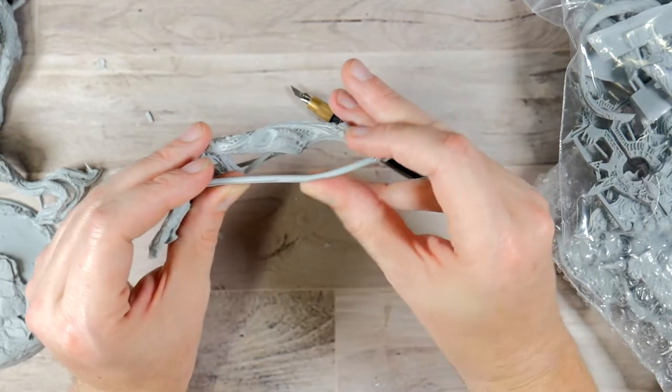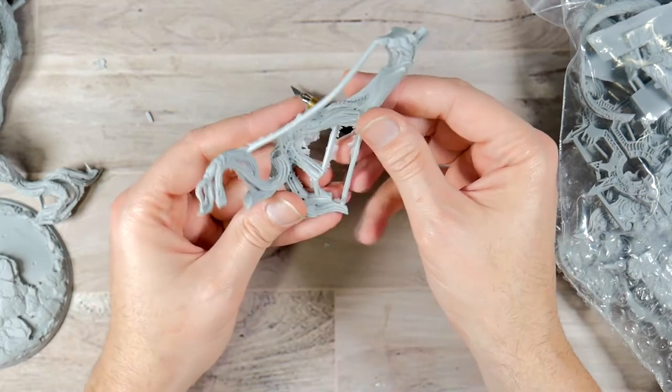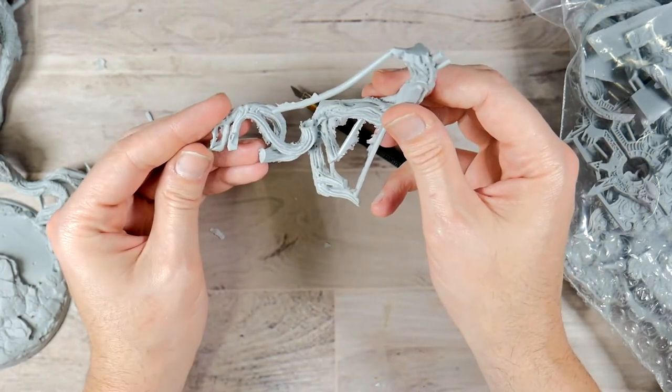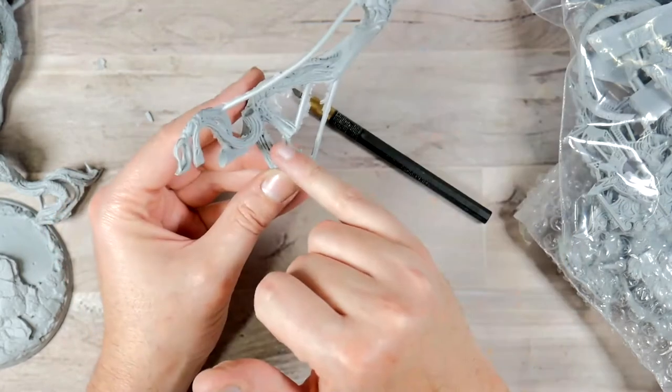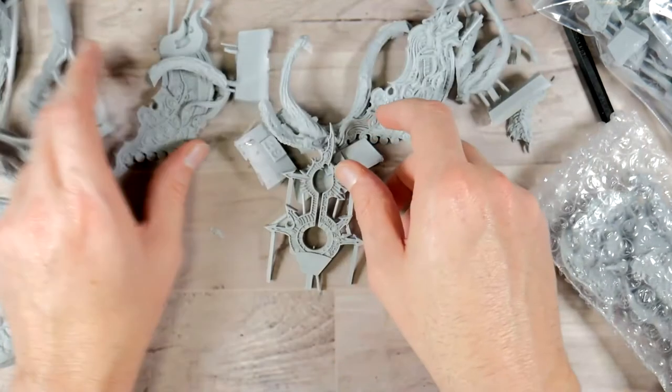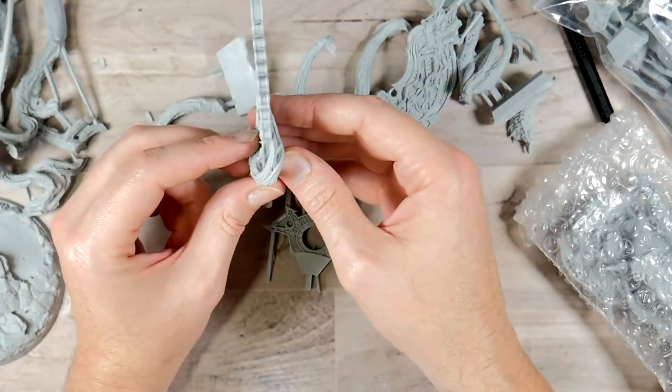This one is kind of bent, probably should be a little more straight, so that tells me that this piece is a little off. No big deal. Again, just warm it up, probably with a hairdryer or some warm water, and it'll get set in there, but all of these will have to get knocked out. For those of you that are screaming, oh, I didn't get a bubble wrap around mine, resin is a lot more resilient than you think that it is.